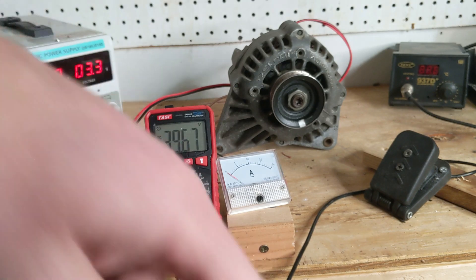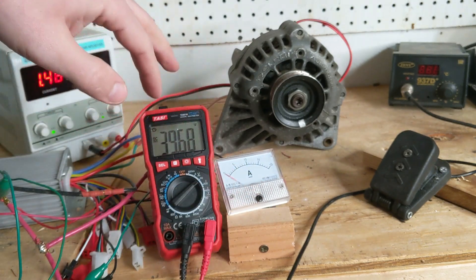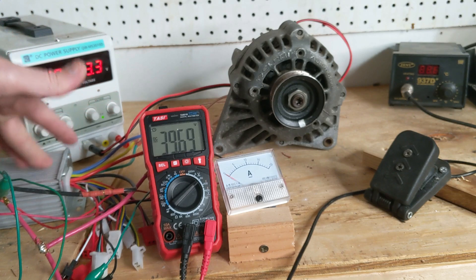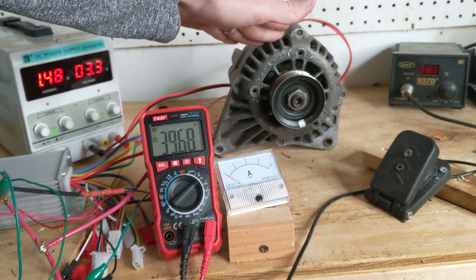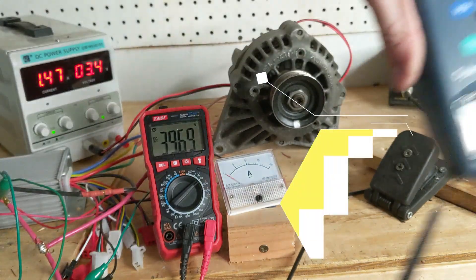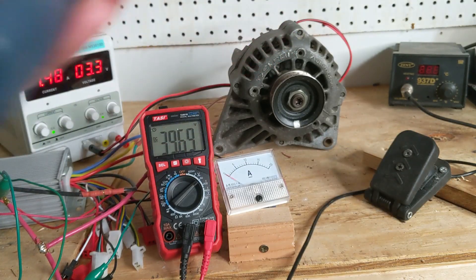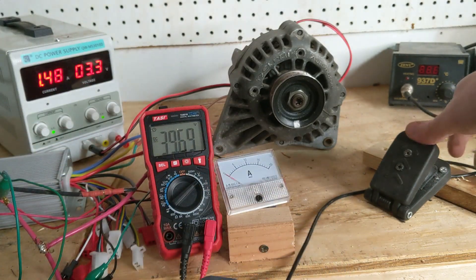The battery goes in series through this ammeter and then in parallel to this voltmeter. I'm measuring the voltage going into the electronic speed controller. I'll compensate for the losses and inefficiencies there, so we'll know roughly the amount of power going into this converted motor. I also have an RPM meter here to find the RPM, and then we can calculate the torque.